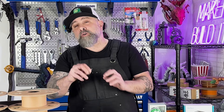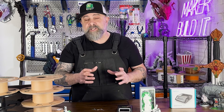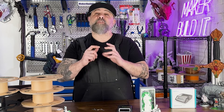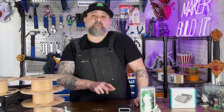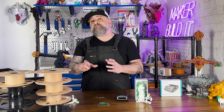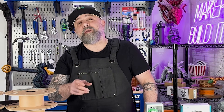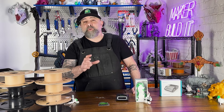This was the first time I used it and I just used it back to back without testing even an initial weld — the first few colors I connected were the ones that failed. If you have a printer with an AMS, you can do something similar where you put four spools and it swaps when one runs out — I do have a video on that. But I'd argue this is still better in many cases: one, if you don't have an AMS, you can still connect filament into a new spool; and two, even with an AMS, you wouldn't be able to use those small sample packets that come with printers or from filament companies.